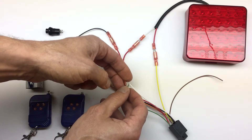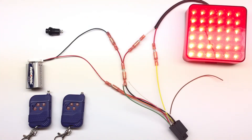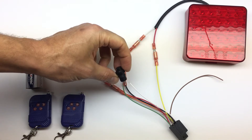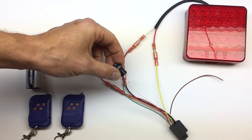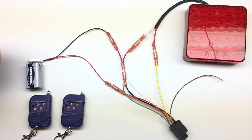You can also use the config wires to activate the cycle. If you short them, it activates the timer again for five seconds. This also works with non-latching and latching mode. So you can connect a button and activate your RF receiver either locally with a push button or with the remote. Thank you so much.